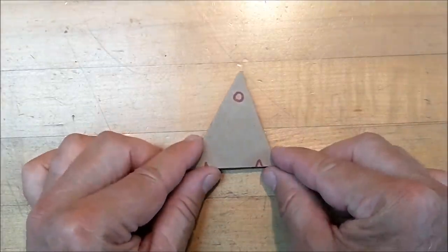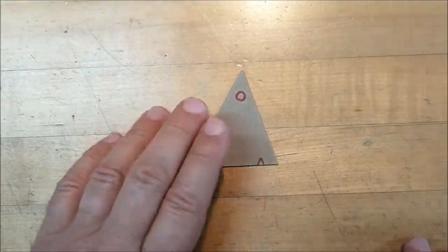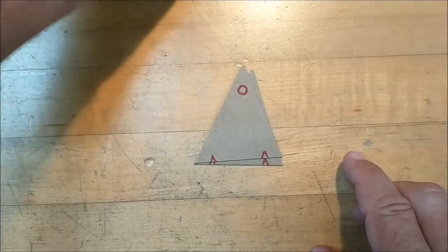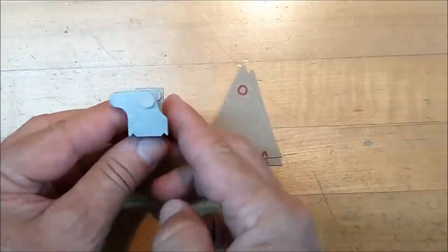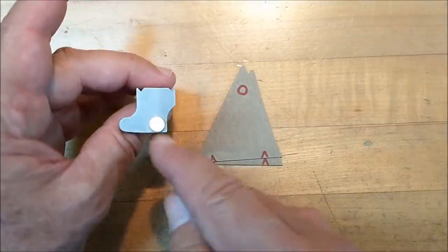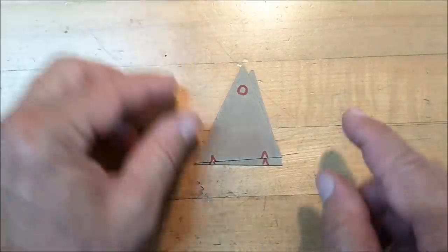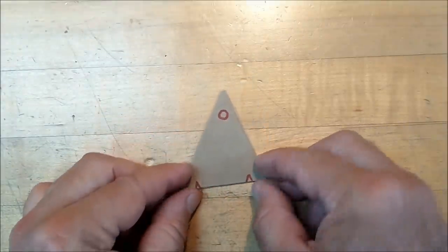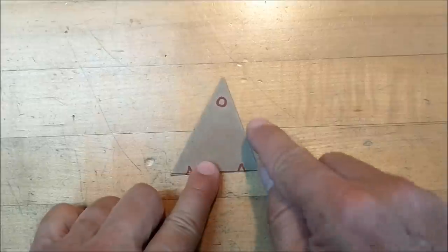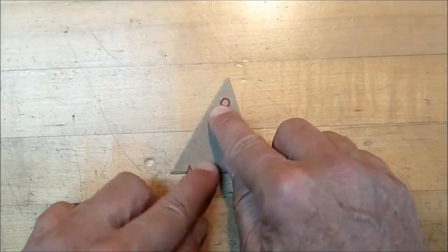Before we get into the actual drilling of the headstock component, I want to illustrate something that's going to probably help you out. We have to be really careful on how the head is positioned in the fixture. Now, naturally, if you think you're working off the V's and you're going to try to hit that hole, you're probably going to hit it. But orientation is critical, and this is going to show you exactly why. Here's the V's that we're locating from. Here's the hole in the tailstock.